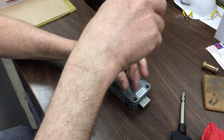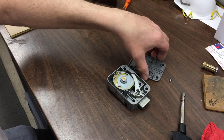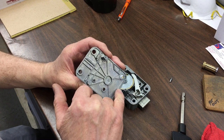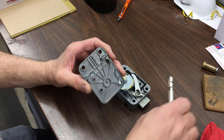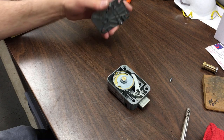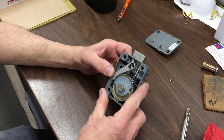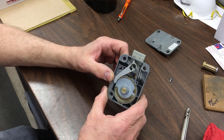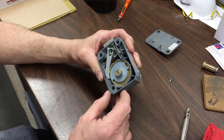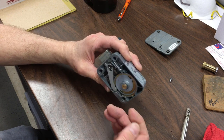Let's take it apart and see what kind of damage he did. There's a bunch of black stuff in the bottom here, and that's stuff that has fallen off of the key as it's been inserted into the lock. Looking at this, I'm not seeing any major indications of problems except for all the black stuff and what looks like oil in the bottom of it.